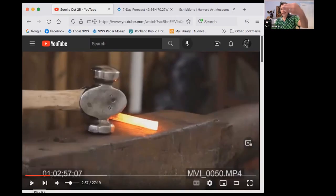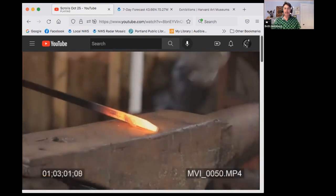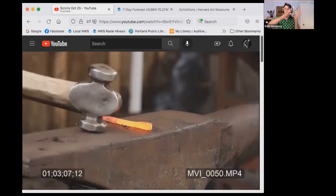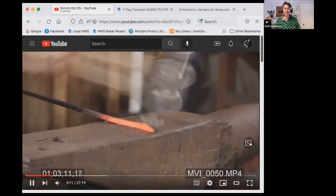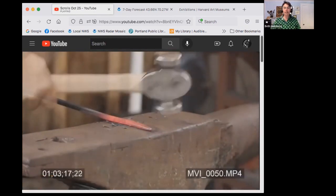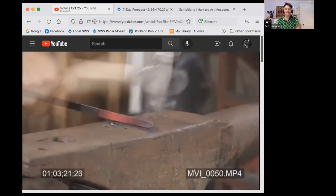So I'm starting in the thickness, in the width, starting steep, making a preform, making a taper the wrong way. And I'm working from both sides and trying to make sure it's well-centered. Then I start very steep with my taper, very, very steep, slowly bringing the angle down and then getting some overlapping blows as I make it a little bit longer, but I'm watching the width. And when the width is out to the original width, I stop.